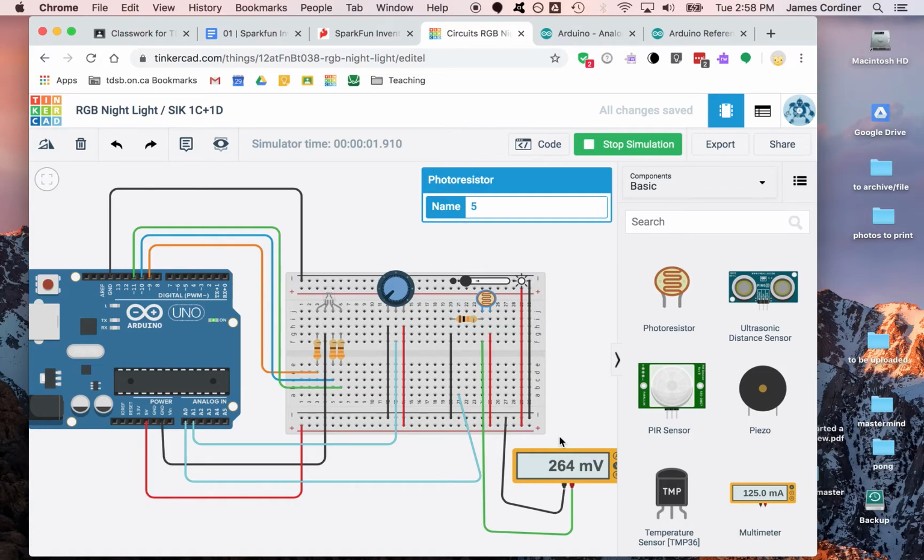We could look at those formulas and try to think about what that means. We want to be careful that we get the order of the two resistors correct in that voltage divider circuit. But you can see that this is now getting nearly 5 volts. It's almost like the wiper, if this was the other part of the resistor on the potentiometer, is all the way over and almost touching the 5 volts at this point. This amount of resistance must be really quite low right now because we're almost getting 5 volts. That seems quite low, and this must be quite high because by the time we read this point on the meter, we're getting almost no voltage, which means that this must be a big amount of resistance, and almost all the voltage has been used up.